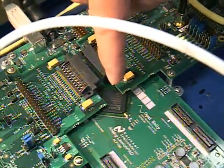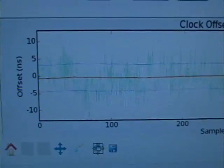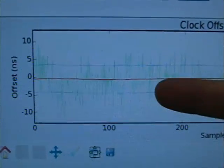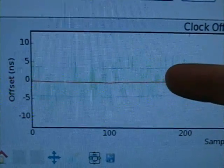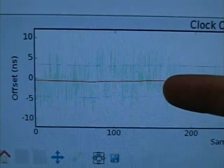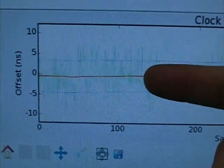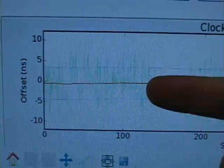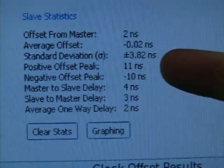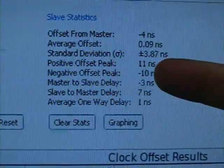Now I'm going to take you to the results on the screen. Here we see the synchronization results between the master node and the slave node. The green results are the instantaneous synchronization offsets between the master and the slave. The red is the average, and in this case the average is about 550 picoseconds — very close synchronization. The key metric when looking at time synchronization in networks is the one-sigma standard deviation, represented by the two blue lines, and right now we're seeing 3.85 nanoseconds. That's a very high level of synchronization necessary for motor control, robotics, and other factory automation applications.